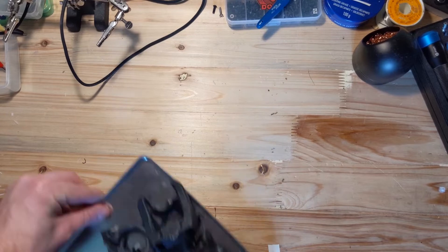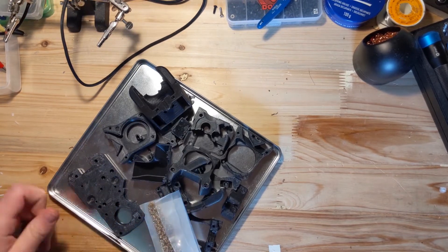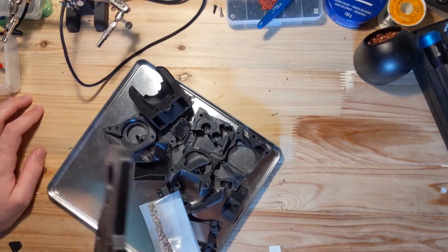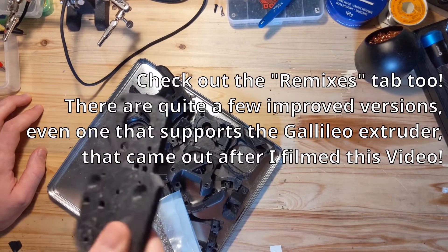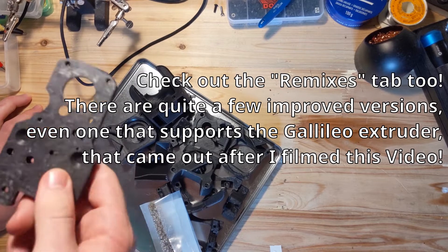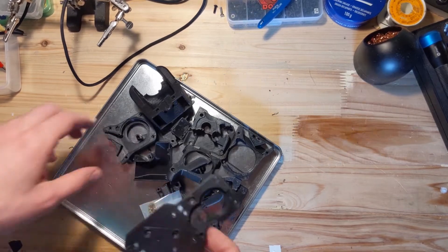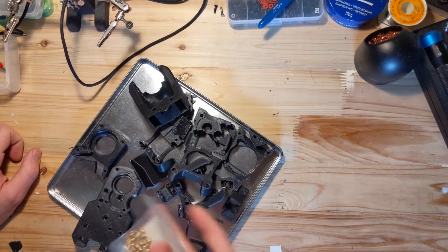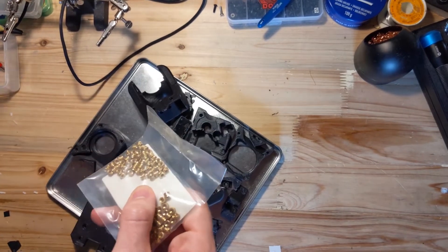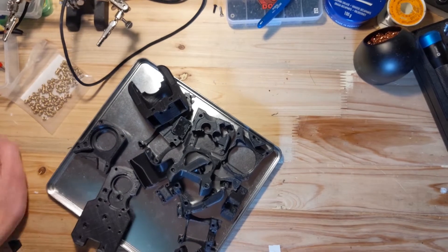Now we are going to take a look at actually building your Afterburner. The first step for installing it on a stock Ender 3 is that you are gonna need adapter parts. I put a link to the Thingiverse page where I got this in the description below so you can upgrade your printer too. This is just an adapter part that fits onto your Ender 3 carriage on one side and has all the right mounting holes for the new hotend. You're also gonna want to start off by installing these heat set inserts, which just fit on the tip of your soldering iron and then you press them in — there are enough tutorials on how to do that out there, I'm not gonna go into detail.